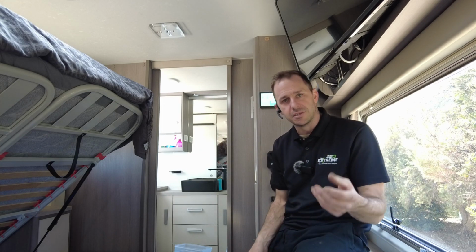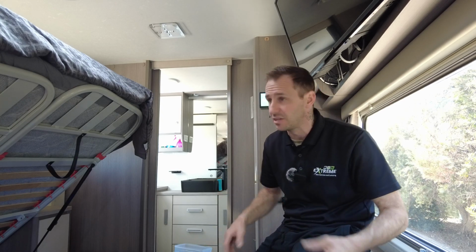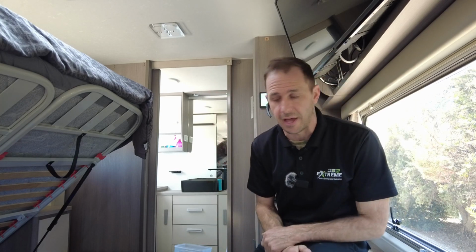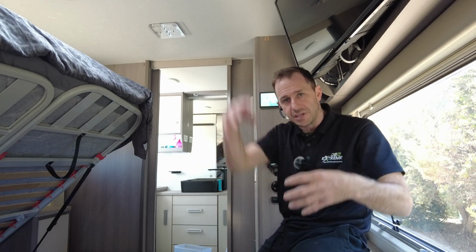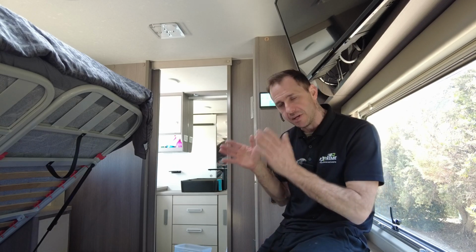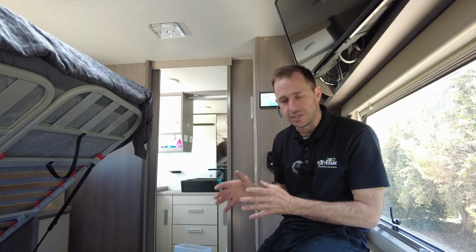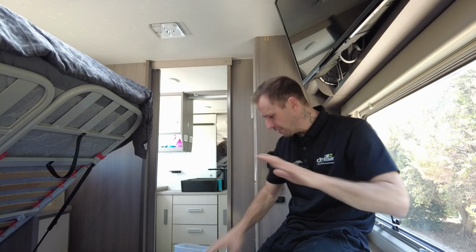In 2 to 3 hours, you would have replaced that just from the generator, guys. Solar's going to be on top of that. You've got to remember that. In the systems that I do, the vehicle, mains, and solar will always pump into the battery if required. If the batteries are in a low state of charge and want the energy, they will take it. So very happy there. Everything's laid out nice and neat.